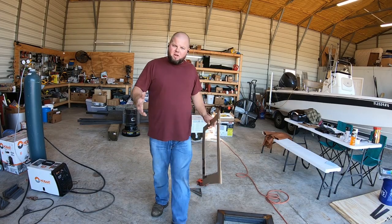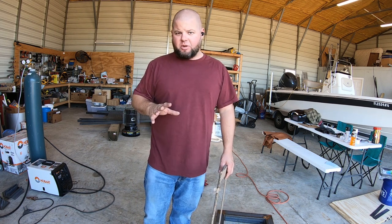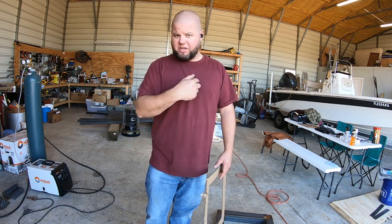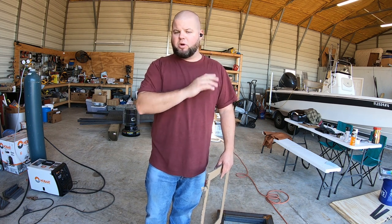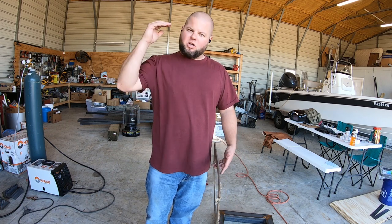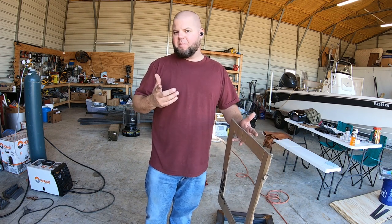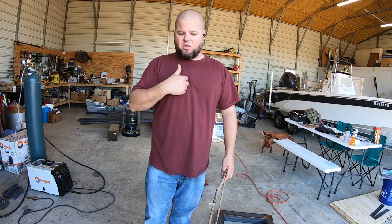All right, so before I ever even ordered the AC, I looked at several different models and they gave dimensions online. So I found one of the larger size ACs, and I did that for two reasons. One, if this AC ever goes out and I wanna order another one down the road, I don't wanna have to find the exact one, or have an opening that was too small that I have to modify, that'd be a nightmare. So I figure if I go with a bigger opening AC, I can always put a smaller AC in it and caulk around it or fill the gap in with something. Two, I wanted as big of an opening as I could get for us to fit through.